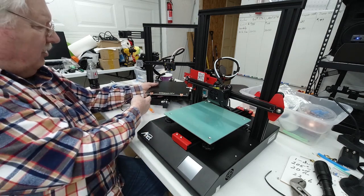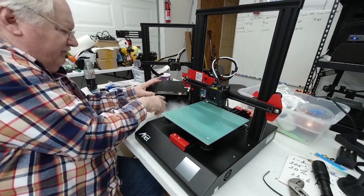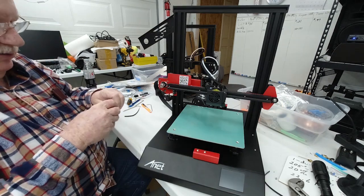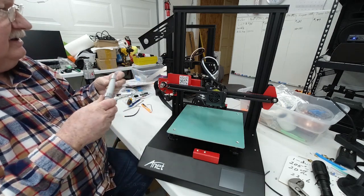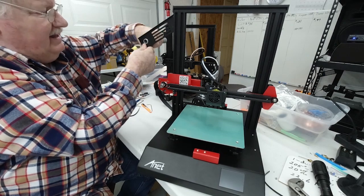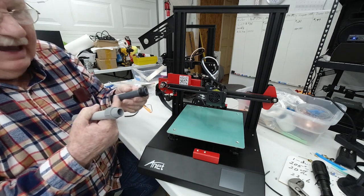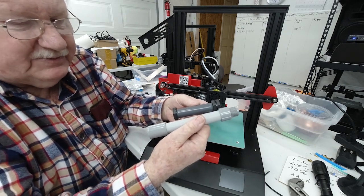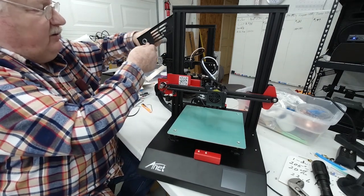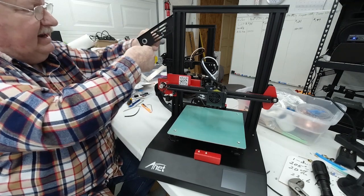It has the 4 rollers on the bed. It has 3 on each side up here and 3 across here. It has the same belt assembly basically. A little different way of adjusting the tension on this one. Of course, I put these homemade rollers on here on all of my printers down here, because the standard roller that comes with this can only handle a spool width like that. I have some spools that are larger, so this one will handle much larger spool width. So I go ahead and do that, so that way I can run large spools, small spools, any of them on these printers down here.